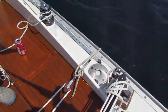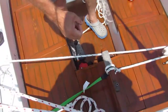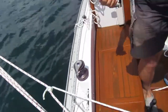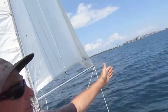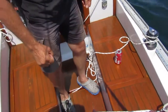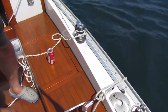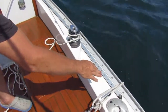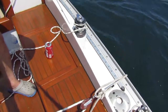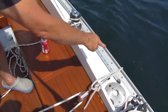You can't easily tell, but the wind is from over here. The bungee cord is always trying to pull the tiller to leeward, which is going to turn the boat to windward — that's what the bungee cord is always going to do. Counteracting that force, we have this control line, which is tied to the tiller with a rolling hitch and goes to this turning block on the windward side. What's really important about this turning block is that it pulls the tiller in the right direction — that's why it's attached to this little rope tied through the rail.